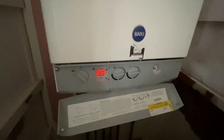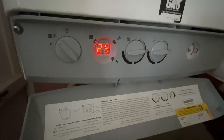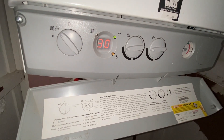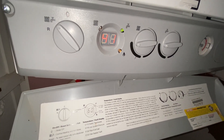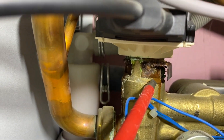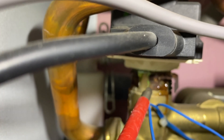We've just been called out to this boiler - it's got no hot water. Just opened the tab and it's fired up, but the tenants reported it hasn't worked all weekend. We'll take a look inside the boiler in case the diverter valve has been leaking. Just dropped the front of the case down and as expected you can see all the water coming from there - that'll have reached up into that motor and it can sometimes trip the electrics.